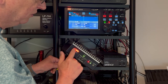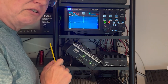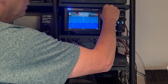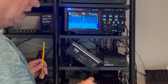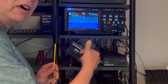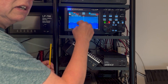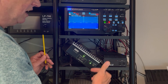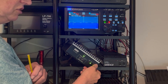There's another control for your receiver. All you want to do is turn the volume up and turn this on and off until the volume levels sound the same. You should not see a jump in audio level when you turn it on — that means the gain is too high. It's that simple.